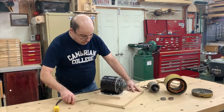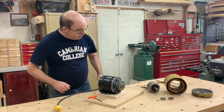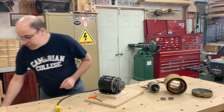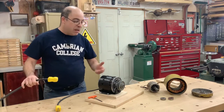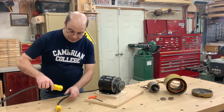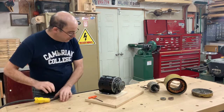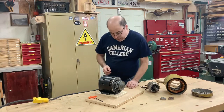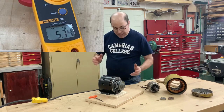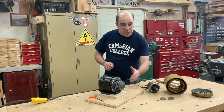Right now it's got a pulley on the shaft. Let's set up the amp meter, plug this in, and get a base reading of how much current the single phase induction motor is going to draw. We're drawing about a little bit more than 5 amps — 5.84, almost 6.2 depending on the load.